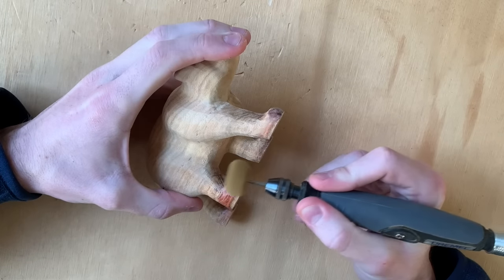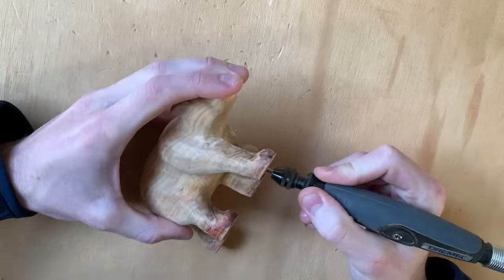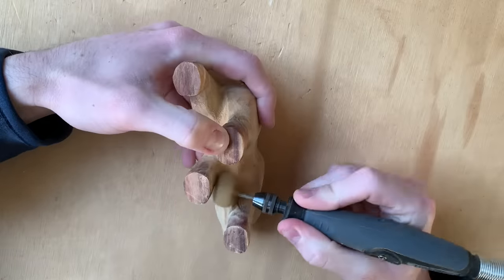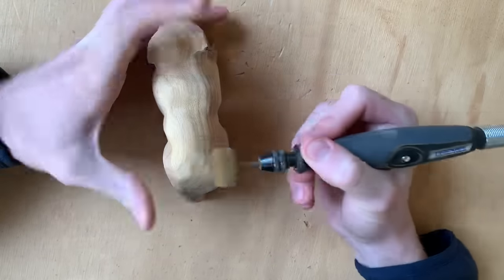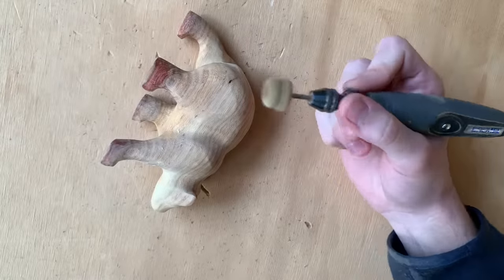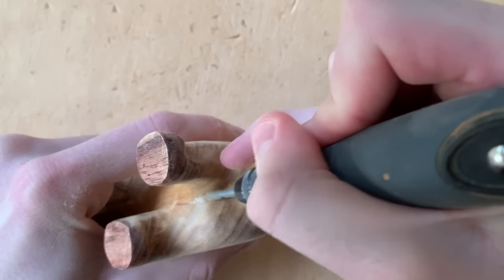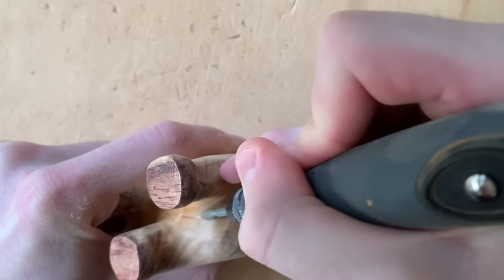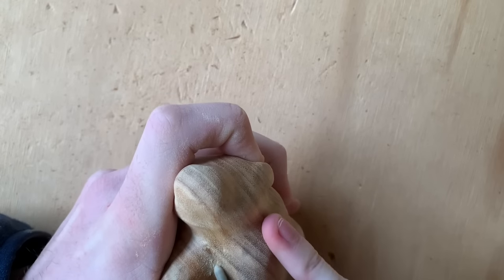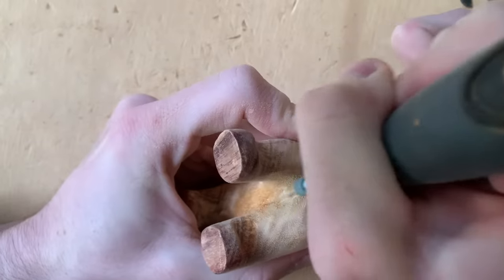The sanding up to 200 grit was done so it was time to use the polishing wheels. These gave a really nice final finish on the wood and they're able to reach pretty much any part of the carving. This one's about 160 grit and I drop down to 10,000 RPM when I use these so they don't fall apart since they're pretty fragile. By the way, all these accessories I'm using are linked in the description below. There were a couple deep scratches on the chest that I couldn't polish out so I used one of these silicon carbide grinding stones at 10,000 RPM to grind out the scratches before returning to the polishing wheel. I also used a larger grinding stone on the chest and on the curves of the feet since they also had some tool marks.